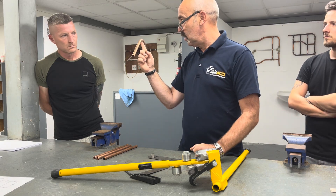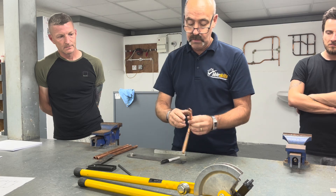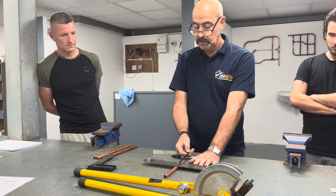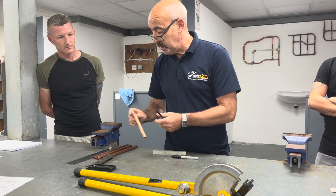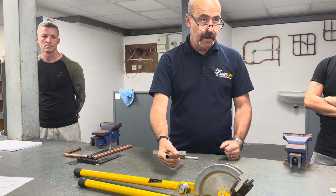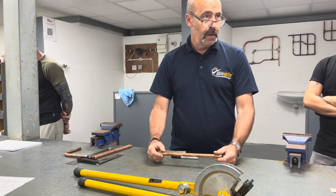If we measure it — good. The bit we wanted, put off to 9 o'clock. Put your big ruler in front, and there's the 150 going right down the middle of the pipe. Any questions? Right — what you're going to do on one piece of pipe and one only: if you make a mess of it, don't worry, we'll come back to it. Don't do another piece. Mark one end, measure down 150, put a mark, go back half a diameter. Put it into the bender — pipe, stop, guide. Move it up and down to line up with your square. Once you're in line, bend it. Don't take it out until you reach the required angle. When you're happy, take it out and measure it.